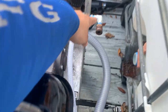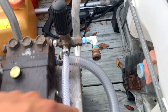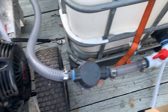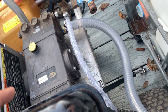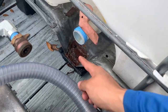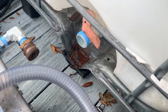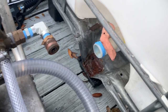I also put a 90-degree fitting for the wand because it was kind of weird — it was like a 45-degree angle toward the tank when I mounted the pressure washer on here. I also installed a brand new inlet hose that feeds the pressure washer. I was going to use some three-quarter inch hose, which theoretically would supply enough water to my four-gallon-per-minute pump.